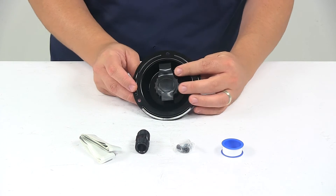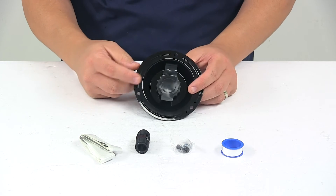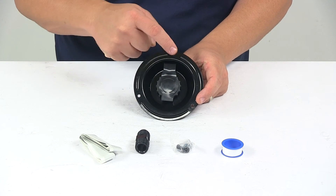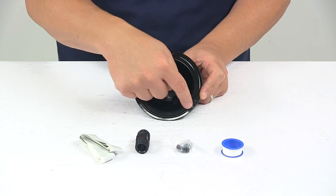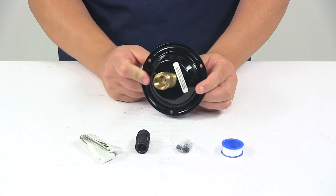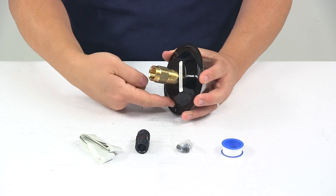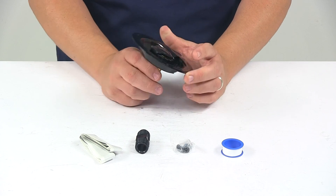The overall diameter of the unit, measured from edge to edge, is four and five-eighths inches. The mount holes going in a straight line are separated on-center from one another by three and nine-sixteenths inches. To get it installed, it is a recessed flange mount and requires a three and five-eighths inch diameter hole for installation.